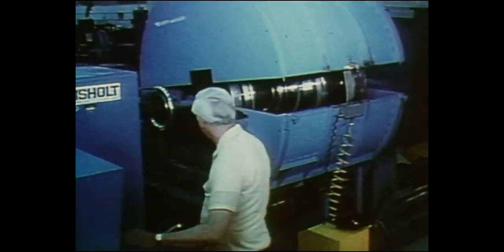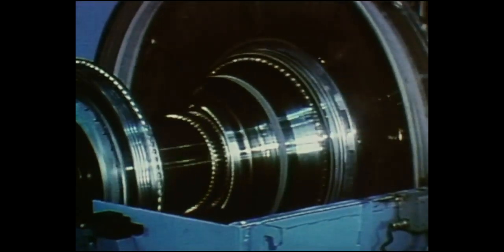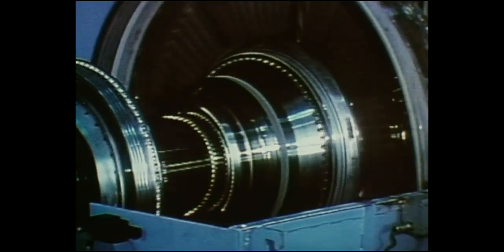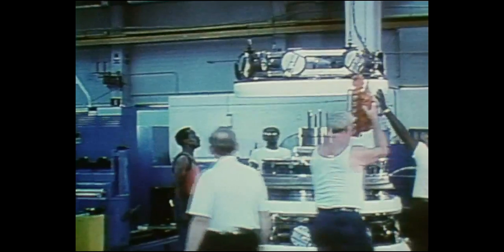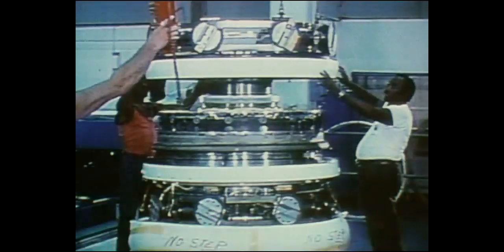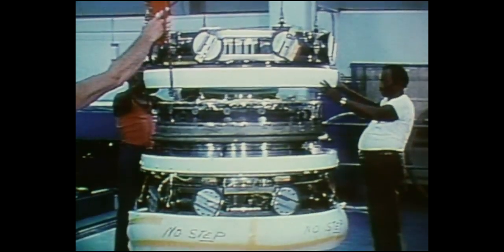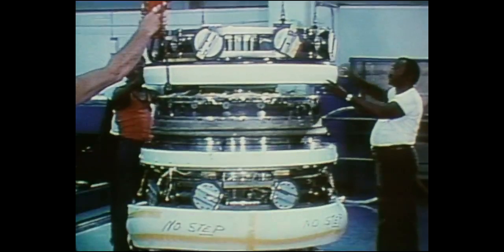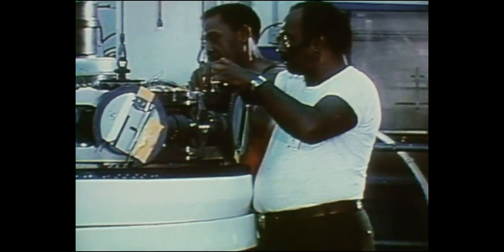Initially, the two rotors are assembled and balanced as separate components. The forward rotor drives the stage one fan blades. The aft rotor drives stage two. After balancing, the rotors are assembled as a complete unit to form the propulsor. Each turbine rotor is supported by a separate rotating power frame. Polygonal rings assembled to the power frames provide for attachment of the fan blades to the power frame.